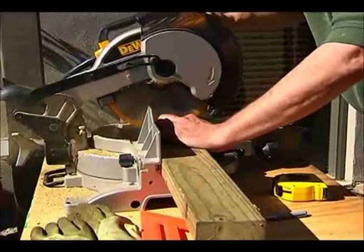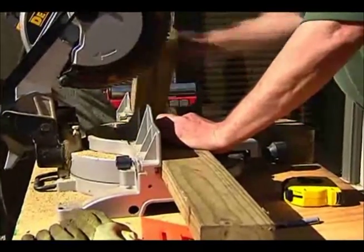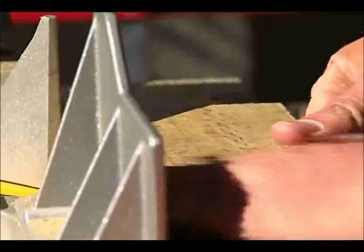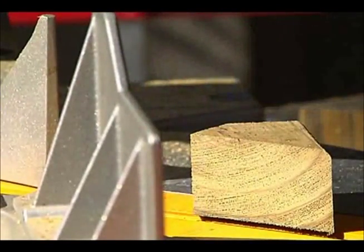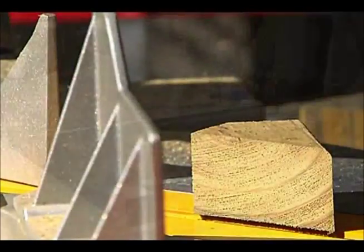Here's what you'll do. Cut 2-foot lengths from a piece of scrap wood to make stakes. Now, if you don't have scrap wood, be sure to buy a 2x4 long enough to make 2 stakes, each about 2 feet long. Cut one end of the stake to a point that you will drive into the ground. If you have the lumber pre-cut at the store, don't forget this step.